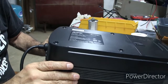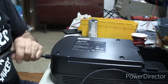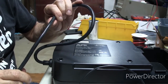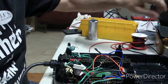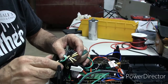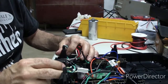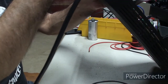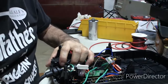We're back. The screws are already out of this. Keep these UPS units around for projects like this — you may need a cord or something else that's in there. There are a lot of things you can reuse. This is 105C insulation on here, which is great. It looks like we've been into this one before. This cord is a nice cord — it looks like it's at least 16 gauge. It's got a choke on it, which is really just for noise interference; we don't really need that. It's got a circuit breaker in it, probably 15 amps, which we'll probably keep. We'll check if there's a rating on it — I don't want to use it if it's 10 amps, but if it's 15 we might use it.